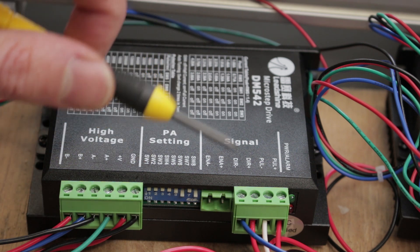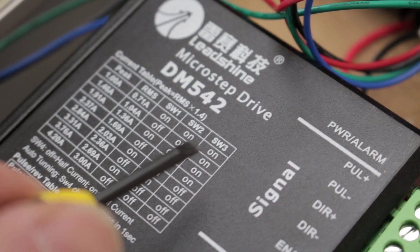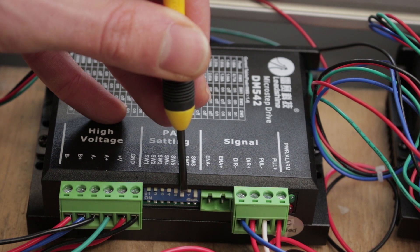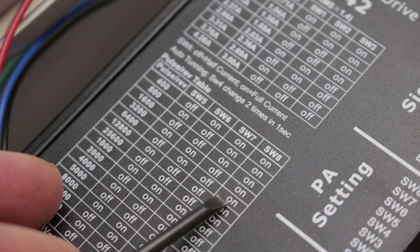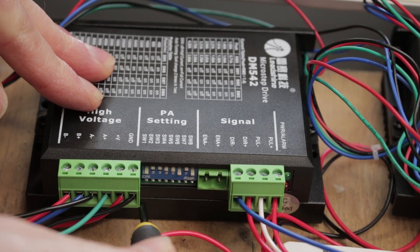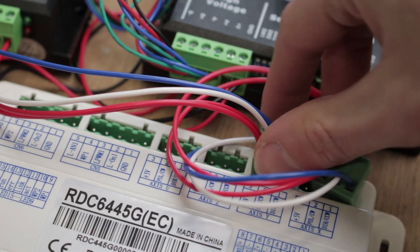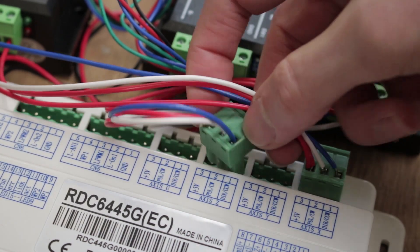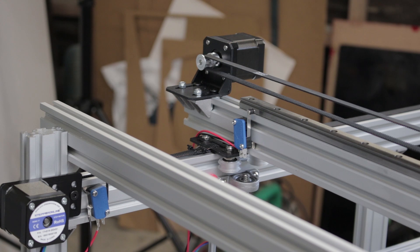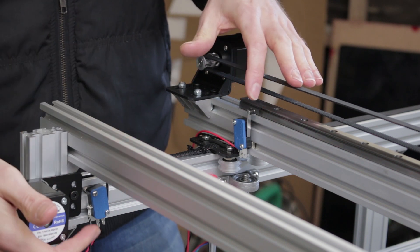Here's my caveman understanding of how much amperage I need: if the motors don't have enough grunt, turn them up; if they start getting too hot, turn them down — the sweet spot should be somewhere in between. I'll start running them like this and adjust as needed. I have the microstepping set to a 32nd because I know that's what the controller is expecting, but a 16th and 8th are also common, and it really depends on your gear ratios of the belts and pulleys. I also just noticed I had the drivers plugged into the opposite axes, so I'll switch those around. And I can also plug the interface into the controller. Alright, enough talking — let's plug this bad boy in. I'm going to stand by the limit switches because I can pretty much guarantee something's going to move in the wrong direction.